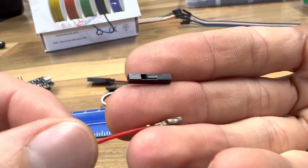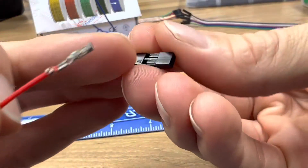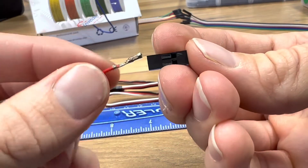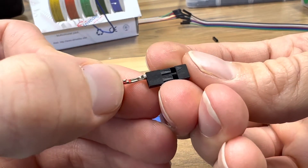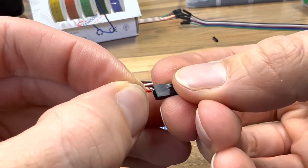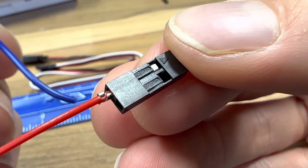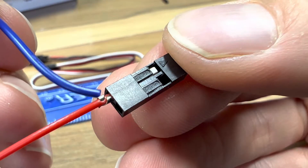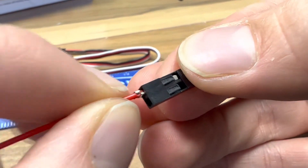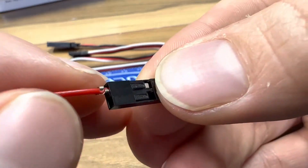Now we're going to put the housing on. Never use individual housings — grab a housing with the number of contacts that you need. You will not have mechanical integrity if you plug into individual housings. Push it in. Look, this one wasn't that great — great example, this happens all too often. These wings get hung up on the back of the housing. You don't push it all the way in but you might think that you have. You do the tug test and it kind of gets stuck in there.